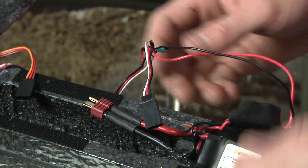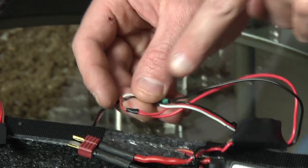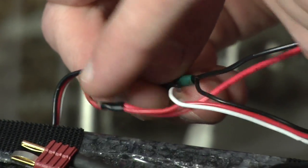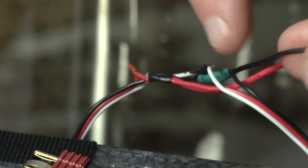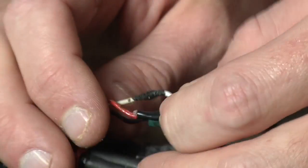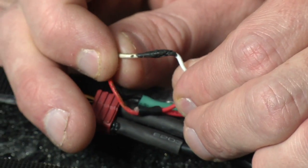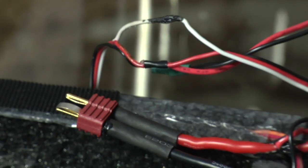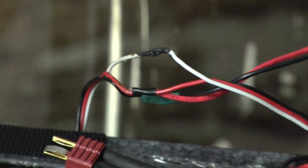What about my video transmitter? I've spliced these cables so I've got my power coming in — this goes to my camera, and that's going back to my video transmitter. Ground, camera, video transmitter. The white wire, I simply spliced right together because there is no power modification to it. This carries the signal from the camera in the front of the airplane to the transmitter in the back. Very simple — don't make it complex.